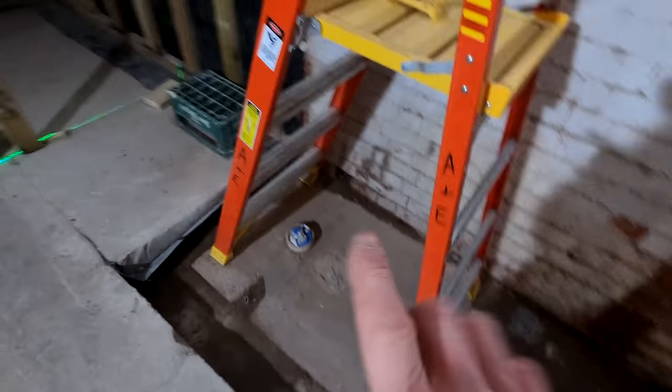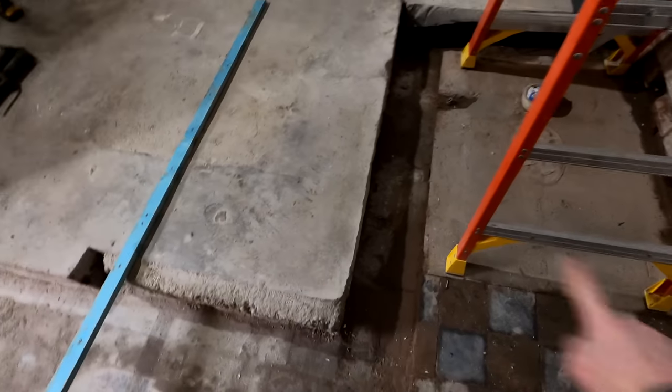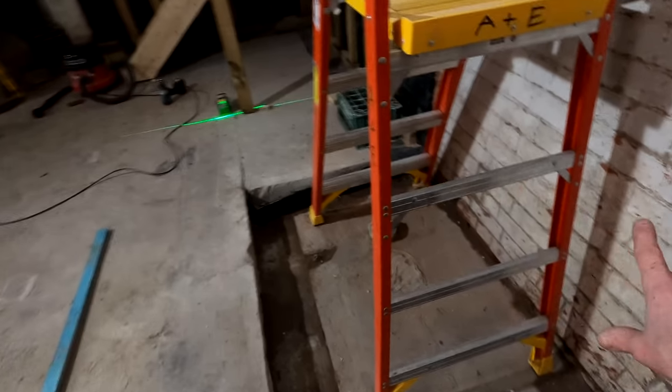So we're going to do one of Pete's pocket doors in there. The toilet will be staying down here as well. There will be a toilet here as well as one upstairs. So we're going to raise this floor level up to this point, bring it out like I mentioned before to there all the way across. And then that will be a toilet and basin in there.